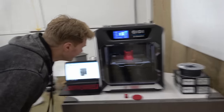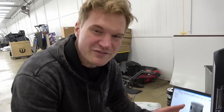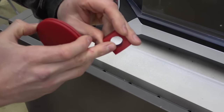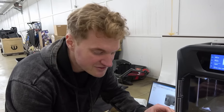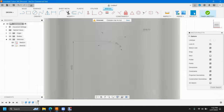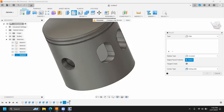So this is the plan — we grew a piston. It looks like it straight up just grew out of the printer, little trees and supports. This is our first test piston; it took a little work to get here. This is the diameter of the piston and the ring groove, and this is the wrist pin hole. All these filaments expand and contract a little differently, so the dimensions you set never turn out exactly right. I printed test pieces, measured them up, and adjusted my model accordingly — made this design from scratch sitting on my couch using my coffee table as a workbench with a $10 set of Amazon calipers. That's another reason we need a test piece: who knows if the wrist pin is actually in the right spot. But we'll find out soon enough.